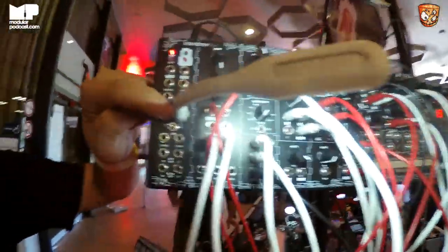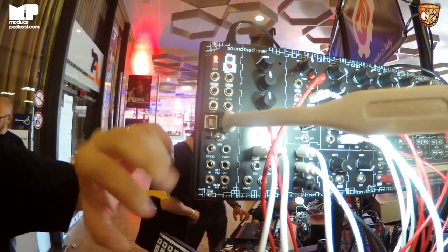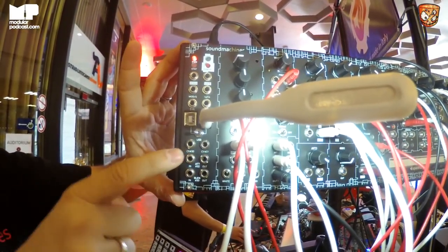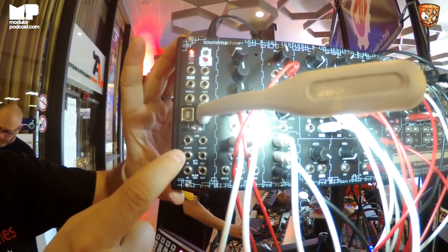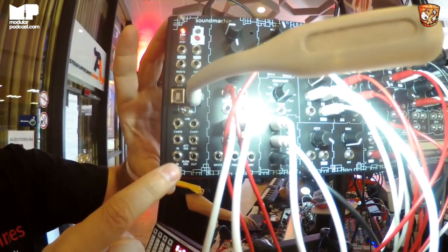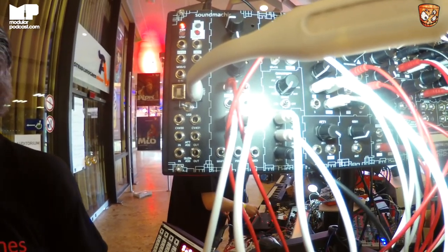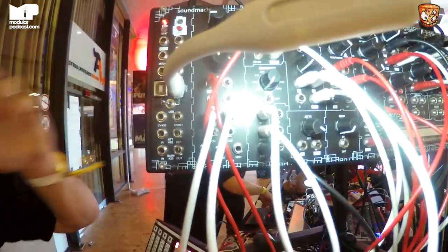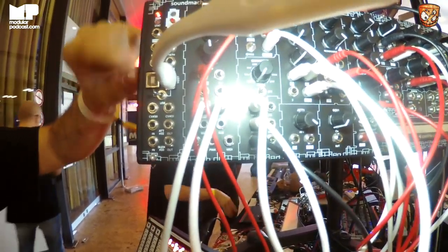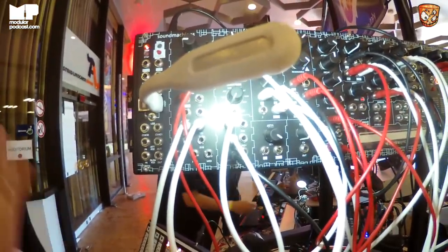And you get a very interesting MIDI implementation where you have the possibility to be a host controller, so to connect directly a BeatStep, for example, or something like that, and to output also two control voltages via CC, one MIDI controlled attenuator and one MIDI controlled slew controller. So it's pretty much above average MIDI implementation for a standard synth. Last but not least, it is getting MIDI clock and it presents on this output as 16ths.